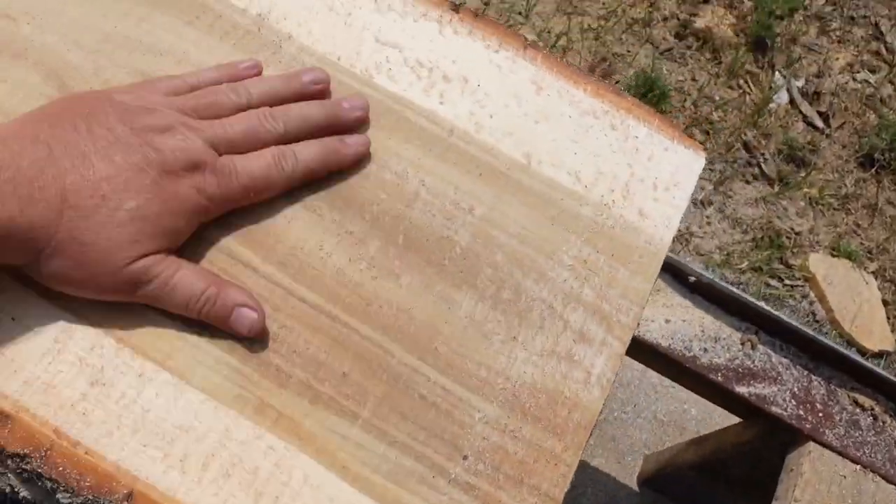Poplar is very popular as a construction material over many hundreds of years. When I used to tear down barns for a living, I found a lot of poplar boards and beams — they just used it for all sorts of things, cottonwood too. Because once you get cottonwood dry it looks a lot like poplar, so it's hard to tell if somebody used cottonwood or poplar. A lot of times the way you could tell is you just take a saw and cut the end of it, and you'll smell it — cottonwood has kind of a swampy smell to it. Some people say it smells like wet dogs or cats, and that's because a lot of times it grows in places that have stagnant water.